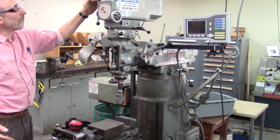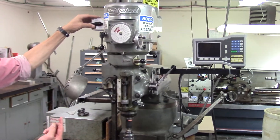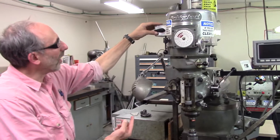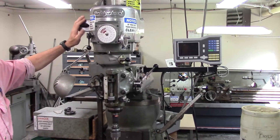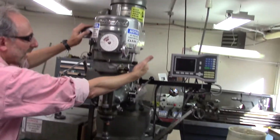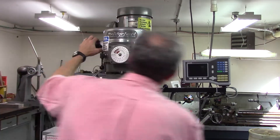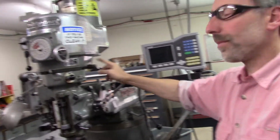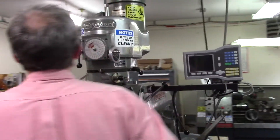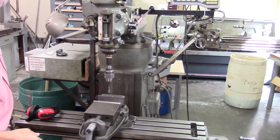The device is powered with this. There's a high range, in which case the tool goes clockwise in high range, or we can change the range over here to low range, and then going down it goes clockwise in low range. But watch out — if you don't change this setting, it will go the wrong direction. You must operate the tool in the range specified on this little nameplate here, high or low range. Right now it's in low range, so if I turn it on at low range, it turns clockwise.